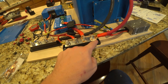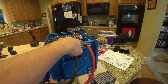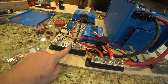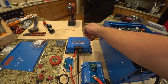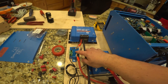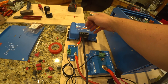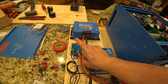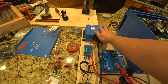From there we get power — this is all 24 volt battery power. Some of that goes into our inverter so we can run all of our 110 AC stuff inside the trailer. We've got our grounds here. This is our solar charge controller — it takes power from the solar panels, does some calculations, and decides how much to feed to the battery. When the battery is full, it stops feeding it. But just in case, we have another battery protect here as a redundancy switch. If this accidentally kept feeding voltage when it shouldn't, or if a setting got bumped, this protect is set so that once the batteries reach a certain voltage, no more power comes in.